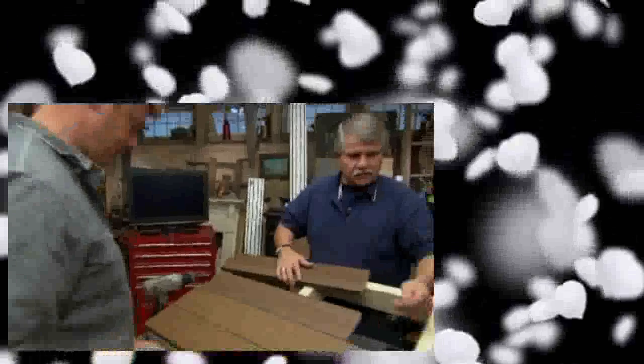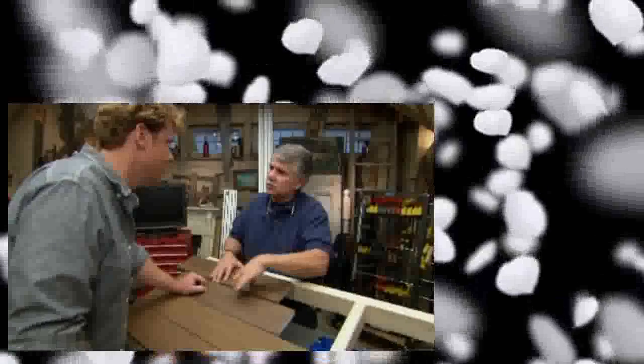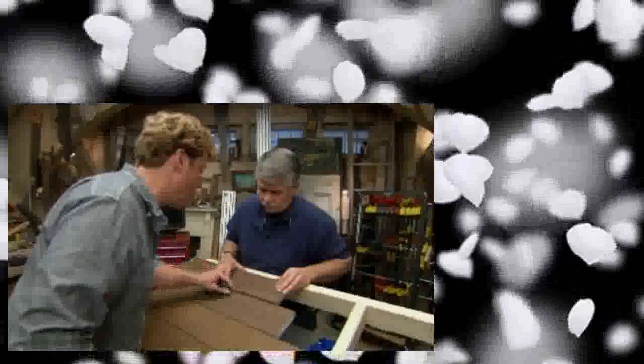They have fasteners like this one right here we use on all of the butt joints, but you can use them all over the field of the deck. They can go into the slot like that. You put a screw in there, then you slide the two boards together. It holds the space and holds the board down nice and tight. Not quite invisible because it's black, a different color, and it's a little wider, but it still looks pretty good.